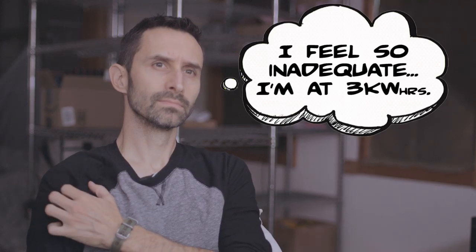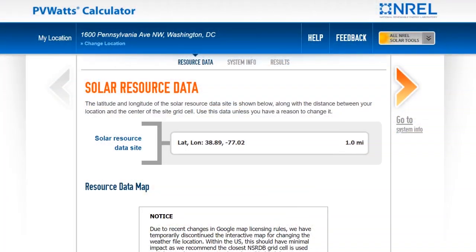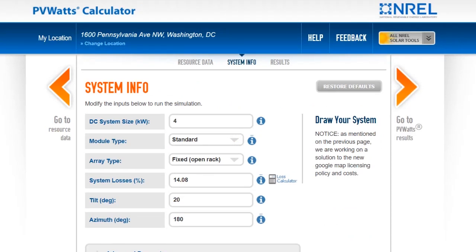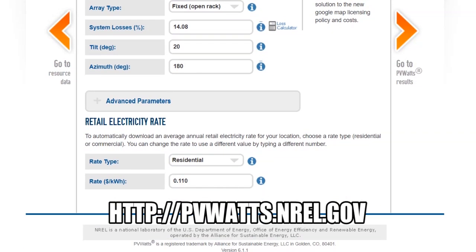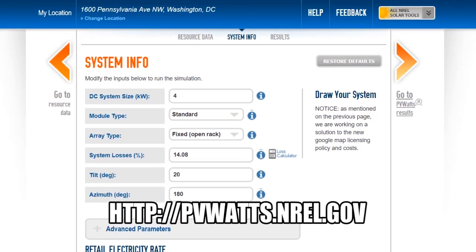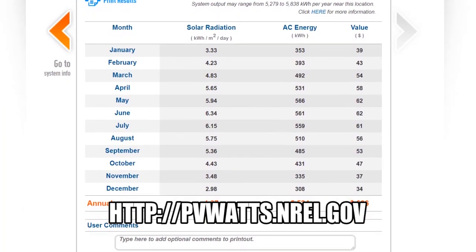How do we pair up battery power, solar power, and inverter size? The question is how much electricity you're going to use in a day. Say you're after 20 kilowatt hours a day — you want to be a little under that as your high peak, because once the battery is empty, it's empty; there's no credit card for battery energy. There's a great little website provided by the US government called PV Watts — Praxis can put that link in the description too. You enter your address, it looks at the weather data, and tells you how much power your solar panels are going to make per month, by season. So you can see January makes this much energy, February makes this much, and it gives you a really good estimate for your specific location.